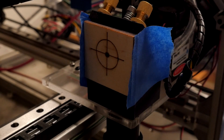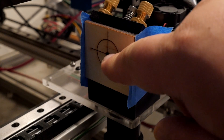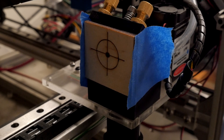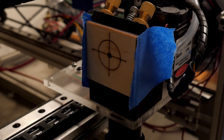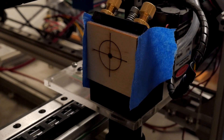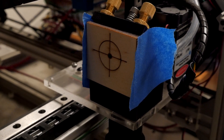Let me pull up the code — this is a 10% pulse at 200 milliseconds. And it's enough to leave a pretty big scorch mark on a piece of wood. So you can imagine how big of a scorch mark it would leave if I were to just hit the test fire button on the CO2 laser power supply.